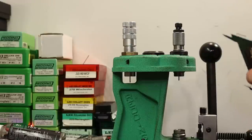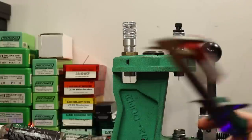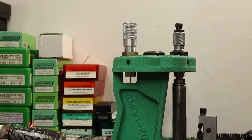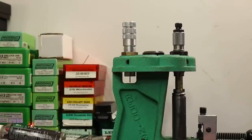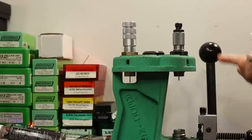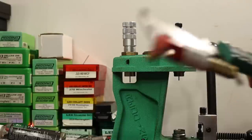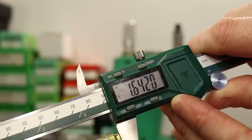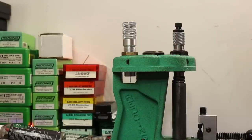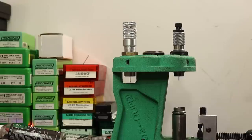Backed it out just a little bit. Same 1.646 before — let's try another one. The expander ball feels good; that's the carbide expander ball that comes with this die set. Still a little too much at 1.642. Backed out more — now at this point still making contact but much lighter, just enough to take up the turret tilt slop in this press.